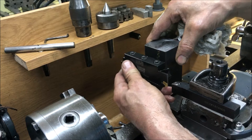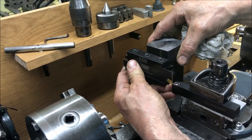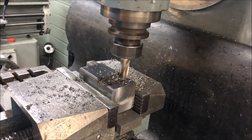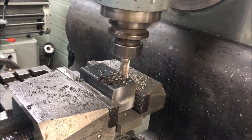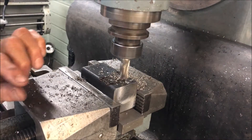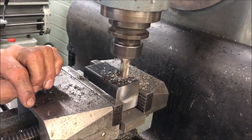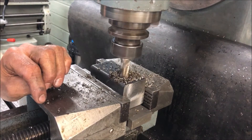I'm just trying to clamp it at the same height as this one — that shows arbitrarily at about five mil down. I'm feeding slowly and manually, just to feel my way first. I have proven that you can take the whole 14 mil or so in one go, but I don't need to do that. We'll also try this with backgear to see the difference.